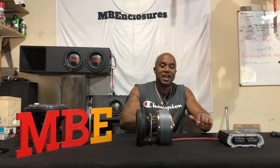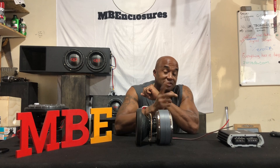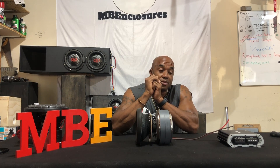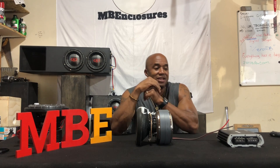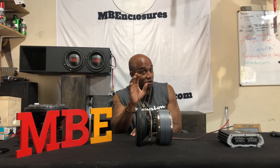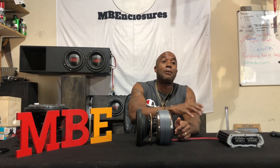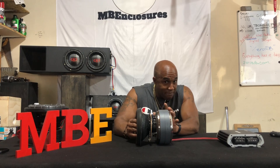As it's moving back and forth under the power of the amplifier, it's creating its own electricity, because you still have wire moving within a permanent magnet. That's interfering with the positive and negative AC that's telling it what to do. A good amplifier can calculate that, and it's basically dealing with the amplifier's output impedance. That output impedance is factored in, and here we go into box rise. When you put a subwoofer inside a cabinet, the air acting upon it, the length of the wire — all these things are going to affect the output impedance coming from the amplifier. It needs to be fairly low and be able to compensate for the feedback that it's getting back.